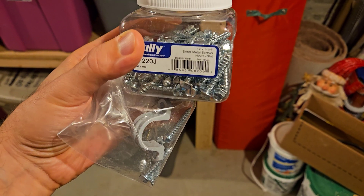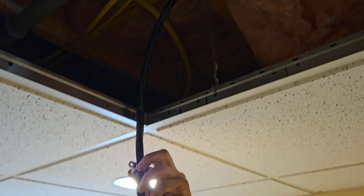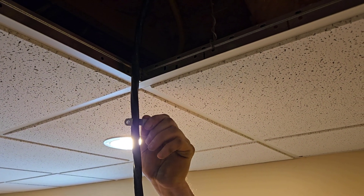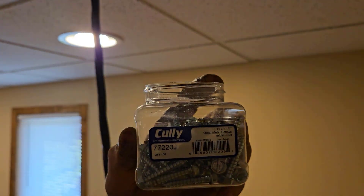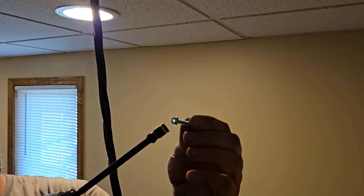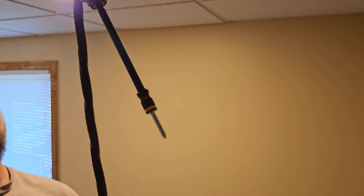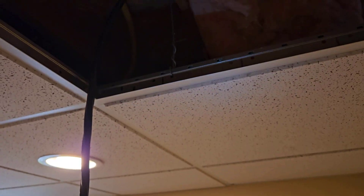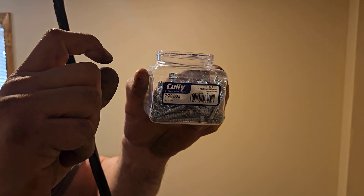Next, a little bit about the hardware you need to attach the wire to the joists in your ceiling. These are two-hole PVC conduit straps for half-inch conduit. They fit a little loose but they'll do a good job holding the wire. A pro tip on screw size: we're using number 12 by inch-and-a-quarter screws. The reason for this size is the depth of the head — it sits nicely in a magnetic bit tip and stays fast rather than being shallow and falling out. Number 10 and number 9 screws have shallower heads and fall out of the bit more easily.